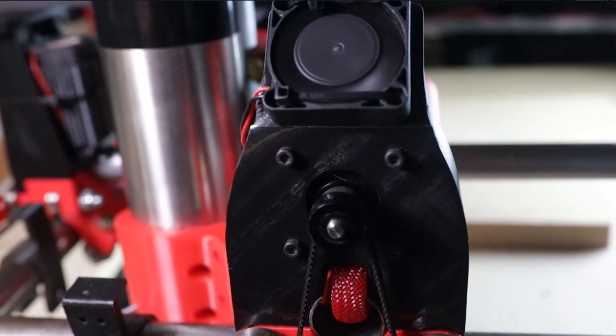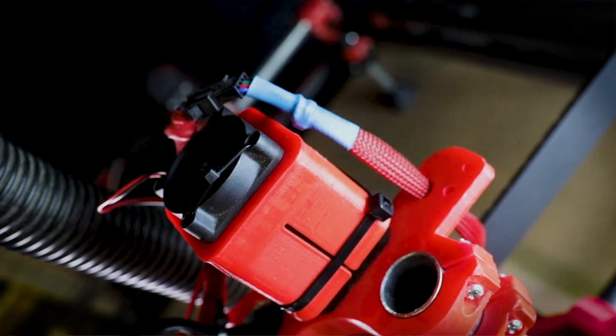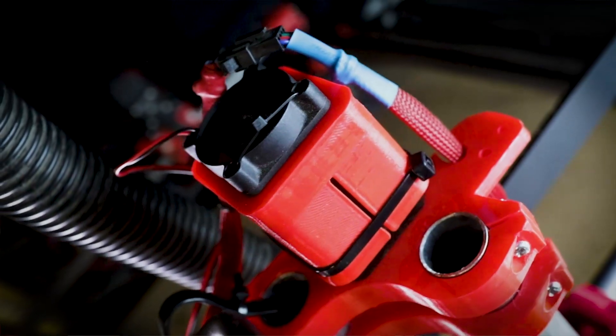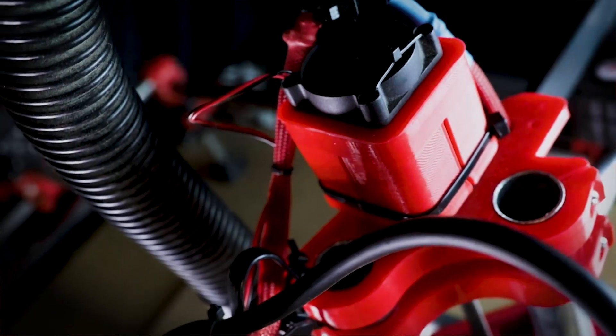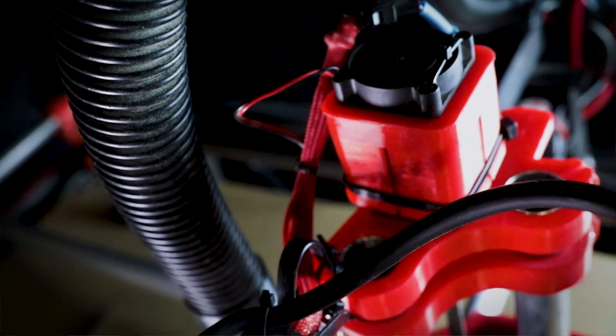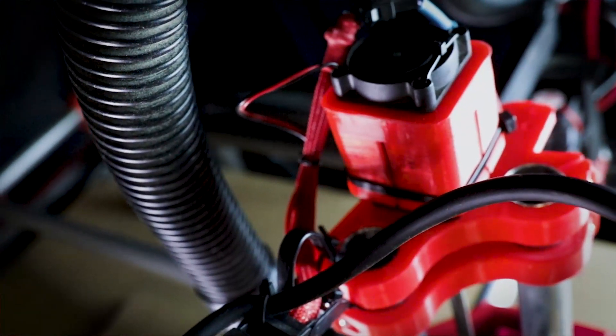This has been an absolute champion for keeping those motors nice and cool — I can run it for hours on end and still only be just above room temperature. I've also done the centre motor on the Z axis, creating a little bracket that slips over the top with one simple zip tie to hold it together. That has also done a fantastic job keeping the Z motor cool with no skips at all in the Z movement.